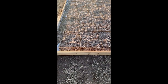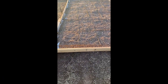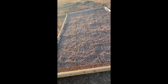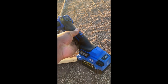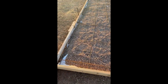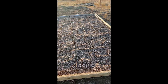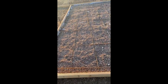I'm out here getting this pad together, got my rebar in there. Haven't leveled it yet, just putting the rebar in and getting it cut off. You don't need any expensive cutoff tools to do your rebar — a Craftsman cutoff tool or something like a Cobalt cutoff tool with a cutoff disc for metal runs about $99, or about $79 if you catch it on sale. That's what I use to cut the rebar. This is a 10-foot rebar, and with the slab being 8 feet wide I had to cut the excess off. It'll get the job done.